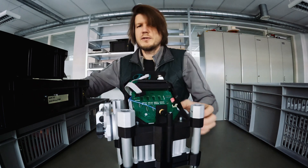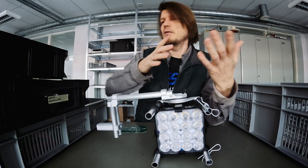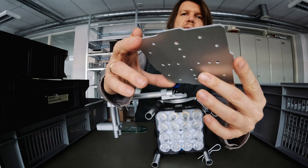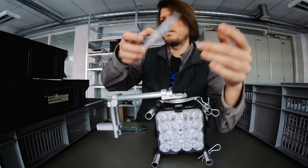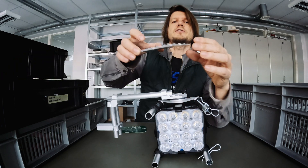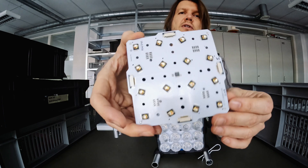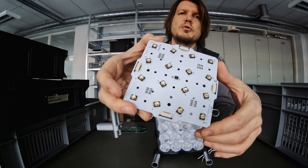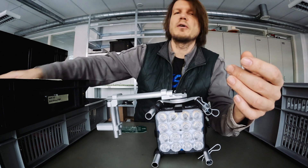Once we're done with this, we basically have the brain of the unit, and then we have the front-facing area — the LED board. Here's an LED PCB, just an empty PCB, and we made the background white to cut down on color fringes or reflection if light reflects back. Here is the same board now with the LEDs already on it. As you can see, each LED is rotated at a unique angle, which enables two things: a very narrow beam angle, and really good color mixing.